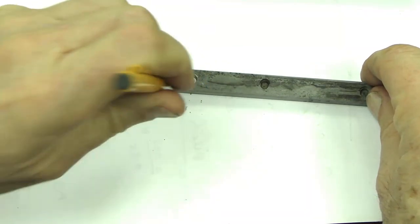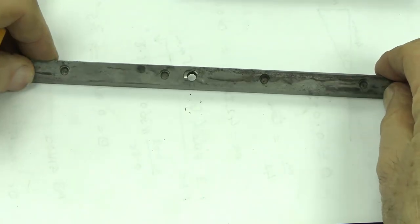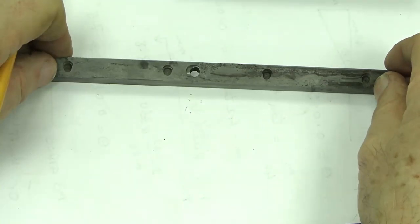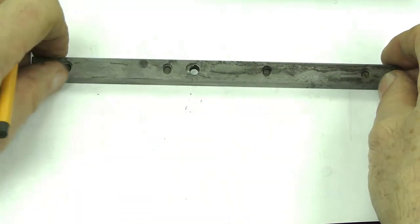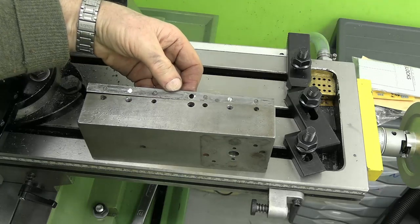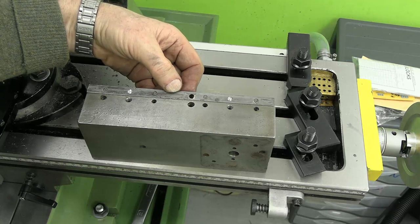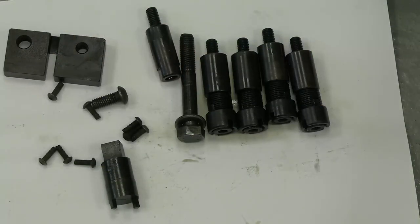The brass lock needs to be able to push hard on this gib. If it had been left up to me, I would actually put two locks in as well — one is a bit feeble. Maybe the right answer is for me to make two new locks and just ignore this. So I've made those two holes and I've made corresponding recesses in the gib. What I need now is two M6 set screws with the right kind of end, which is exactly what I haven't got.